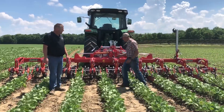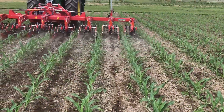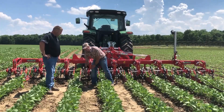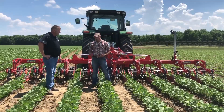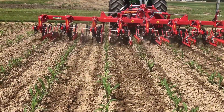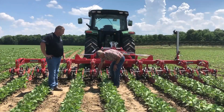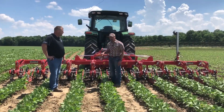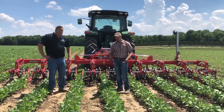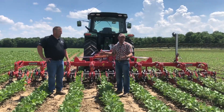The other adjustments we can make with this cultivator are the width of the row. I can move these front sweeps in and out and get as close as I want to that row without taking the crop out. Then I can adjust these row shields up or down, or take them off. Down for small crop, up for bigger crop — so I can throw some dirt closer to the row to cover up any small seedlings that might have emerged and try to choke them out. I can also adjust my depth — every single one of these shanks is adjustable. Once I get the initial depth adjustment done, I adjust it with this crank row to row. Unlike an old cultivator where you had to unbolt a clamp and move it, I just crank it to a number — say six is a generic number — and I get every row there, so I know I'm all equal.